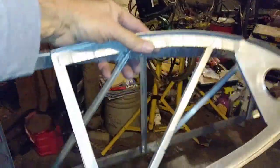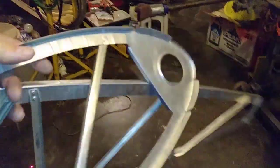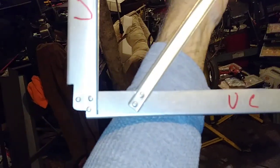And that really comes in handy when you cut that hole in the bottom skin to put the spar through on the fuselage. And then here is an extra set of ribs that I made just to show people. All those little pieces there were bent on that 12-inch Harbor Freight slip roller shear and brake, and then riveted together with 3/32 solid rivets.